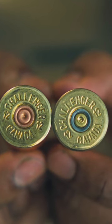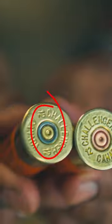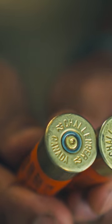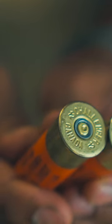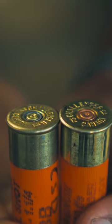Let's look at the signs of too much pressure before things go catastrophic. The shell here to the left had way too much pressure, and you can tell by looking at the crater where the firing pin hit the primer. You can see it's not just a dimple — it's a dimple with a crown around it.